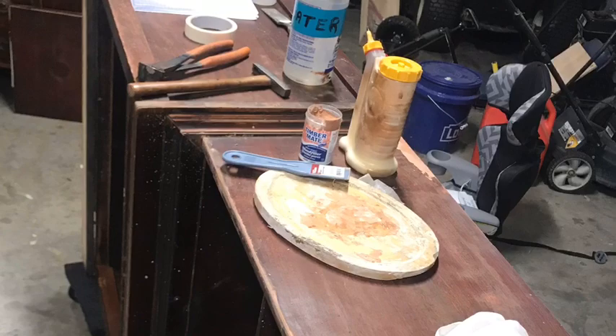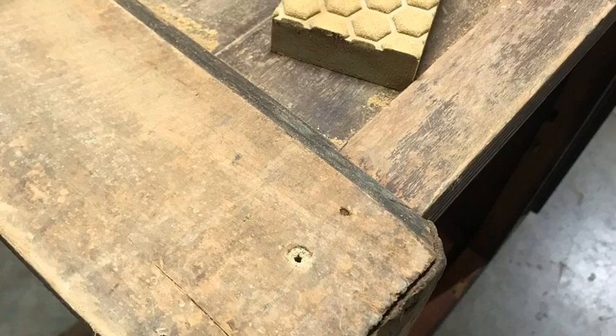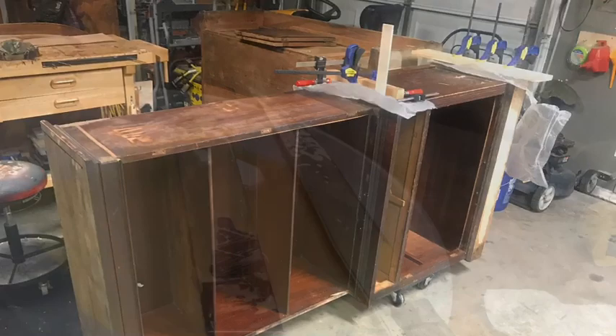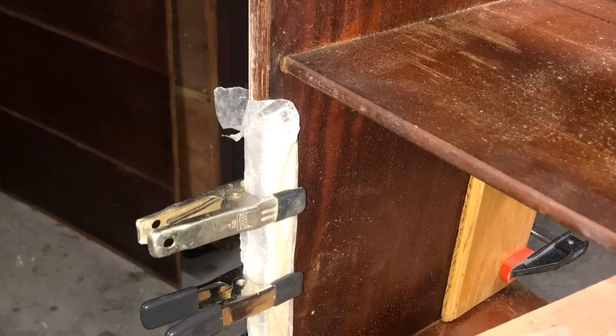These are pictures of the glue, straight edge putty knives, and tools I used to glue up certain areas. I took notes on every piece of the project — the glue-up, the veneer, the missing pieces, the buckling pieces. Here's a picture of the unit laying on its side with all the panels glued. I used straight edge boards to put additional pressure on the glued areas, along with Bessey clamps, Irwin clamps — pretty much every clamp I had in the shop.